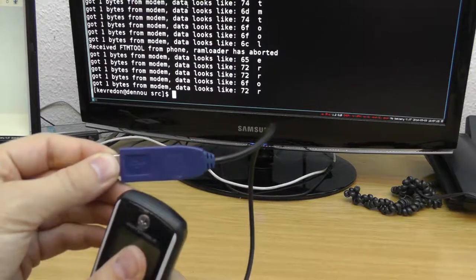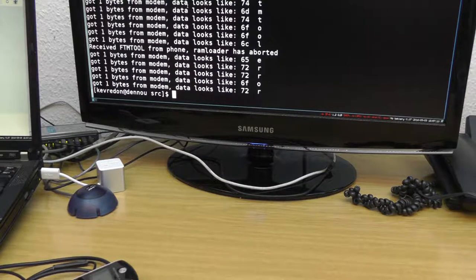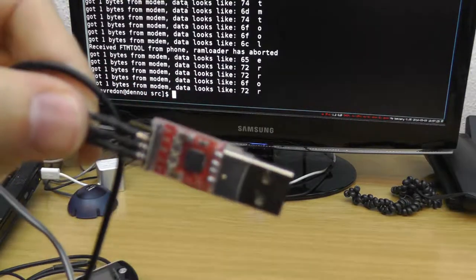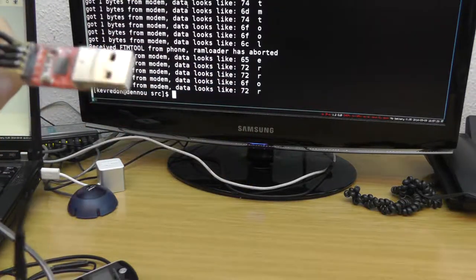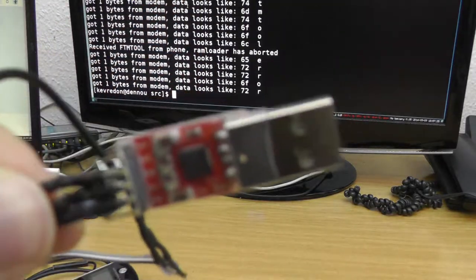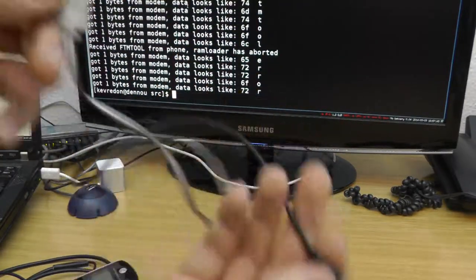I often find this USB to serial converter quite unreliable. The cheaper ones use the Prolific PL2303 chip — very cheap but not as good as others. The best ones are FTDI USB to serial converters which use an FT232 chip, but they're expensive. In between, you have ones using the Silicon Labs CP2102 or CP2104 chip — very inexpensive, and you just connect the 2.5mm jack to it.